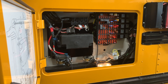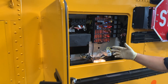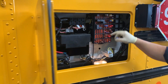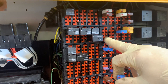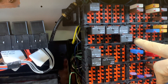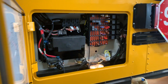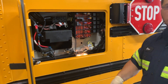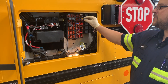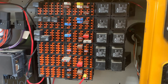Anyway, when you're looking at these panels, if you're having any issues at all with any kind of associated circuit and you just want to pull out breakers and look at the terminals, a lot of times you'll see the terminals will slide back into the connector body — and that can cause a lot of problems. It'll just be intermittent connections. Customers would be like, 'Hey, my heaters just work intermittently on and off.' And a lot of times it's just something really simple like that. So make sure this goes in the right slot again.